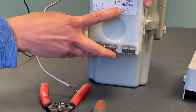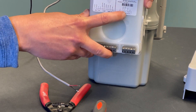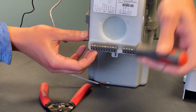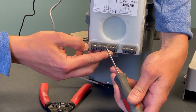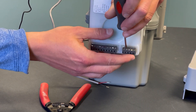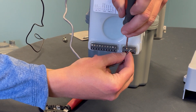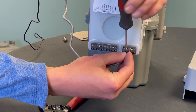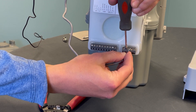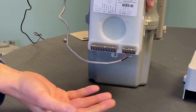We're going to be using terminal 12 on port 1, which is the pulse in, and terminal 14, which is the ground. Take your terminal screwdriver — if you get confused, just count 1 through 12. Back out the terminal screw slightly and add the positive or red wire to terminal 12. Tighten down until just snug. This is a small electrical component, so use no more than about two fingers to finally tighten, then give it a slight pull to make sure it's seated correctly.